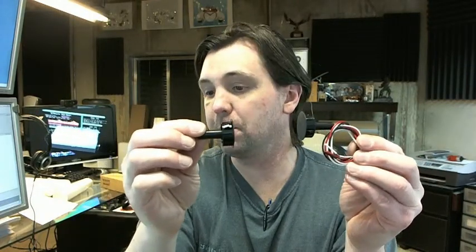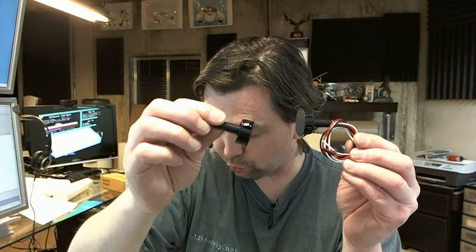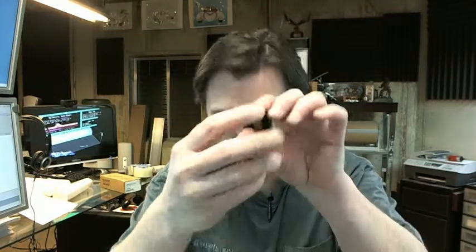This HM version is specifically for a hollow metal door and frame. If you have a wood door and frame, or a wood door and a metal frame, this is not the right one. This is specifically made for a metal frame — you drill a one inch hole and then this will pressure fit into the hole. As you can see there, the raised area will pressure fit into the hole.